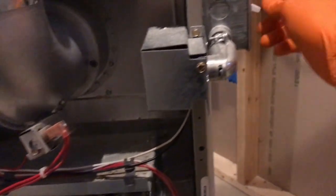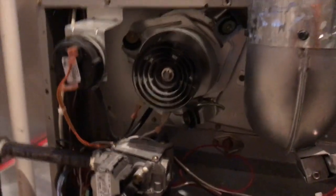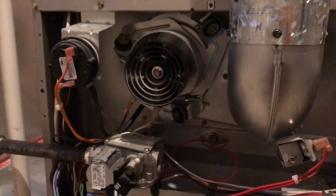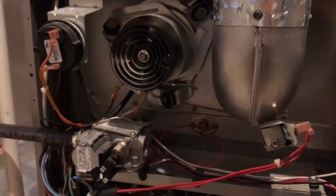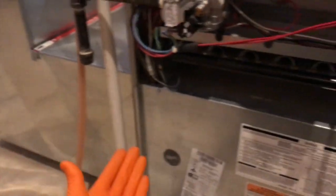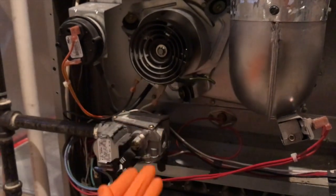Your blower motor will go into its 90-second test. If ventilation is properly detected, your igniter will get power and turn on. Inside here are your burner tubes, and way back in there is your igniter tab. You can hear the power — there's your 90-second test of your blower. It may not take 90 seconds — it may take 20 seconds. However, it's extremely important that your system has proper ventilation to properly run, and once it detects proper ventilation, everything will turn on.